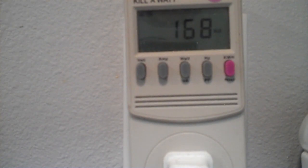The other downside is it only provides 150 watts — that's what they advertise and it does deliver. But the thing I don't like is it really doesn't have any surge capacity. A lot of inverters rated at 150 watts continuous can do 300 watts for a second or two to get things started, because many devices have surge current on startup. I have a 40-watt-max hot glue gun, and it turns out it interacts badly and makes the inverter shut down. When I plug it in using my Kill-A-Watt meter, it goes up to 155–168 watts for about half a second before settling back down to around 40 or 50 watts — so it may just be tripping the limit.